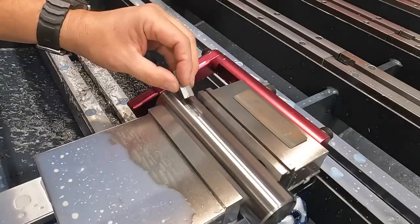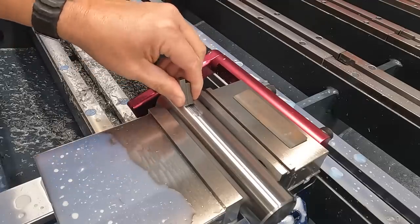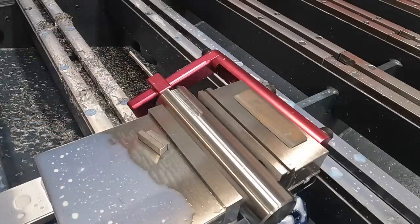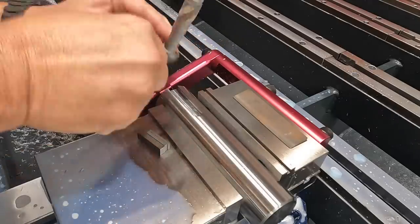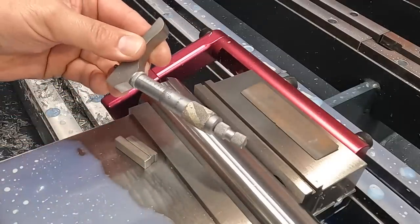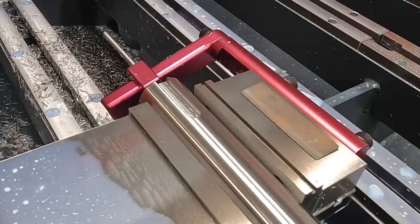But here's our gauge block stack up, and it's fitting in there good. Still have that right amount of friction there on the gauge blocks. So that should be good. And then let me grab my depth mic and see what we're measuring on our depth there. 250 thousandths. I know you can't see that with the GoPro, but that's 250 thousandths. I say we're good to go. It's time to get the final shaft in there, and let's make our final two cuts.